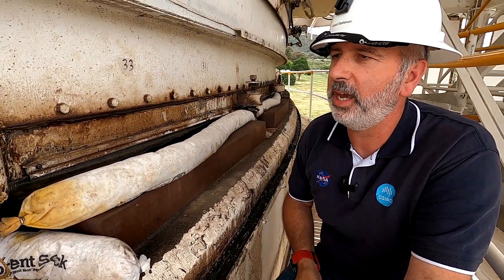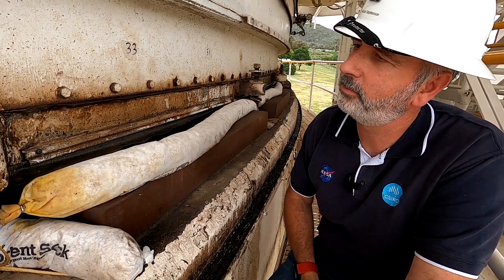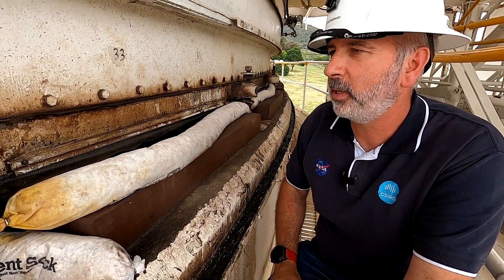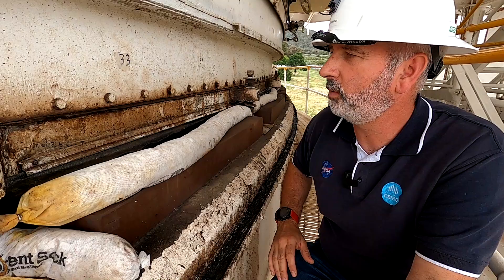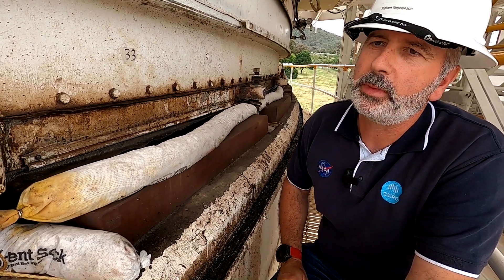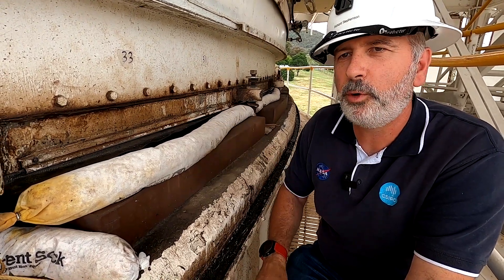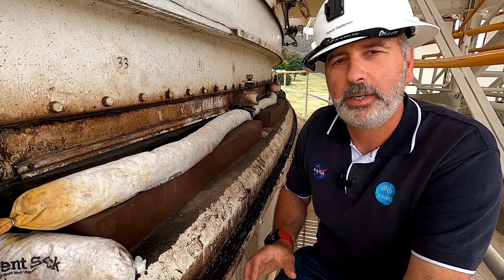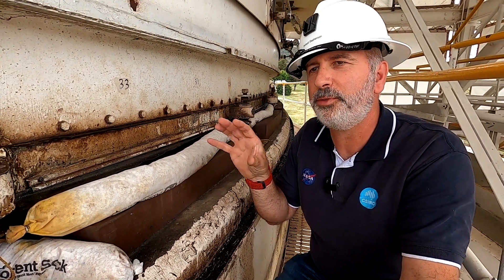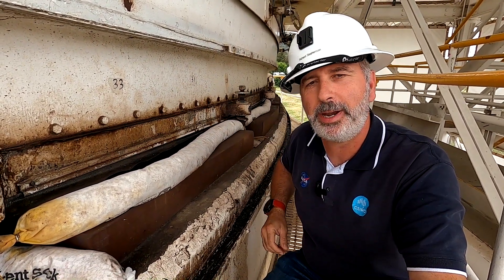Inside this reservoir here, we have an oil reservoir that goes all the way around the antenna. We don't actually see the runner because they're sitting in a film of oil, or a reservoir of oil. Now, the pads themselves — although we're lifting 4,000 tons — that 4,000 tons is only lifted at three points, so we have three pads sitting on the runner.